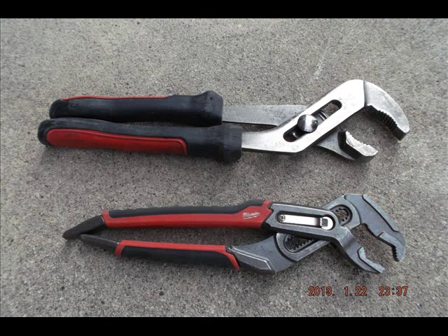These are my channel locks. I should have a bigger pair, but these two pretty much handle 95% of any jobs that I need channel locks for. The Milwaukee ones on the bottom are nice because they have a fast ratchet so I can just push a button and change the depth. They also have front and back reamers that can be used to ream out half-inch EMT. They're not as useful as they look compared to a dedicated reamer driver, but it's nice to have an extra set. If you're going to get channel locks, you should get two — for most jobs you need to hold something and rotate something else at the same time.